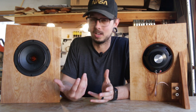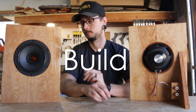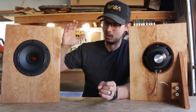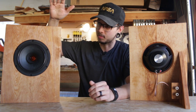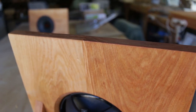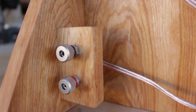That's what's so cool about these enclosures — it's just the speaker, a little bit of speaker wire, and some terminals. Now onto the build. I used one six-foot long by six-inch wide stick of solid birch from my local big box store. All I did was rip that piece down to five and a half inches wide on my table saw, cut them to a little over 15 inches long, and glued them together side by side. There's actually a seam that goes down the center of this front baffle. I used what was left of that for the kickstand and the terminal holder.